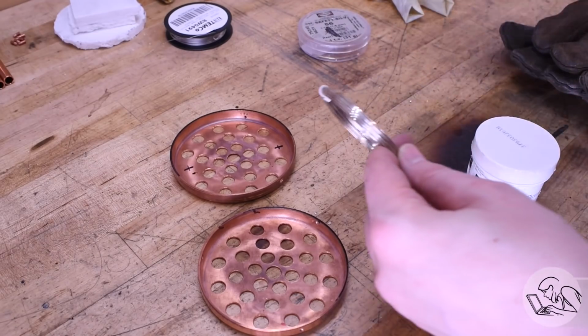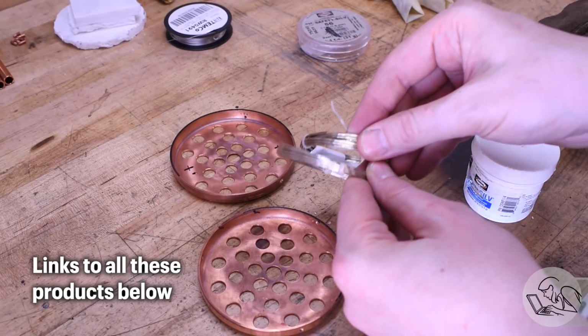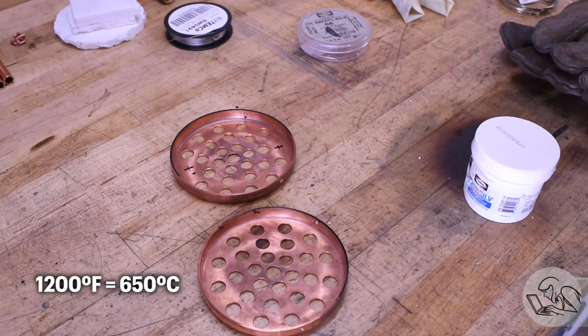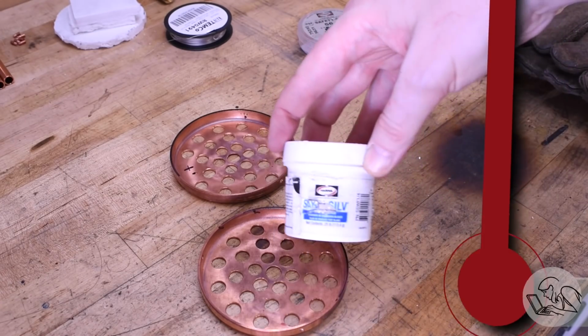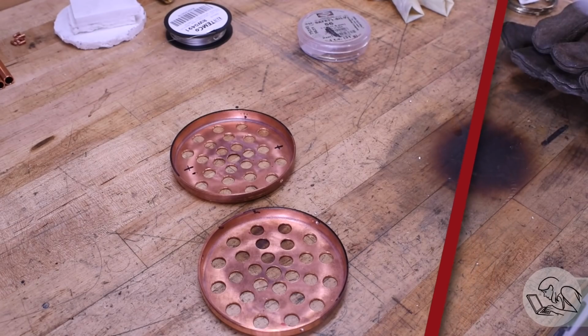The silver solder that I'm using is Harris Safety Silv 56. This is a cadmium-free low-temperature silver solder. So it melts at about 1200 degrees, perfect for this application, and I'm using their accompanying white flux. A quick sidebar on silver solder, because I think a lot of people from outside the model engineering world aren't very familiar with this stuff or why we use it.